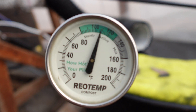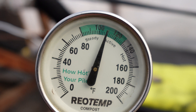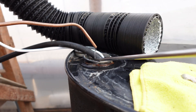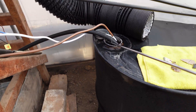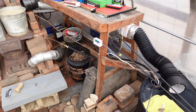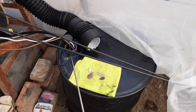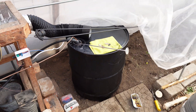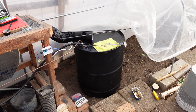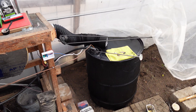So here we are at about the one-hour point — one hour after starting the fire — sitting about 109 to 110 degrees with a steady rate of flow constantly. We really only had heat transfer for maybe 25 to 30 minutes of actual heat coming through. So if we had this going for three hours, we would be able to raise the tank quite a bit. We might come back out today or another day where we have decent sunlight and take some more data from this thing.